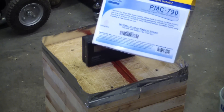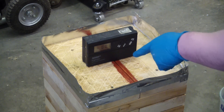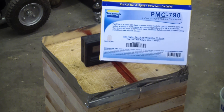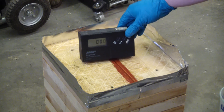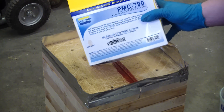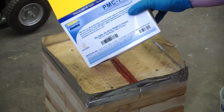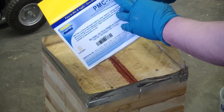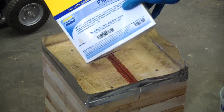The brackets are outside, all painted and flashing off. I've built up a dam with some aluminum tape and put some silicone caulk down the middle so the urethane rubber doesn't squeeze out the sides. It's all leveled off. Now we're going to use Smooth-On — I like it better than Luma-Cast because in small quantities it's cheaper and easier to get here in Canada. This is PMC 790 industrial liquid rubber; the 90 is the Shore hardness, so it's real stiff.